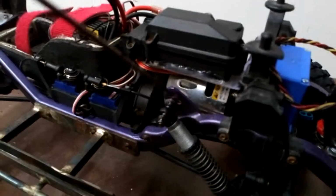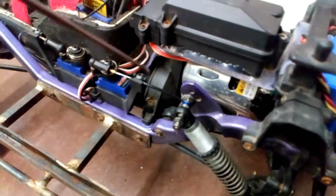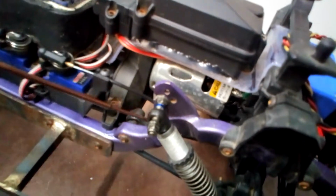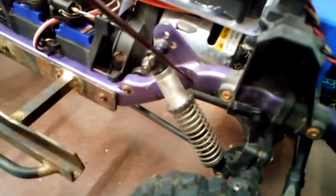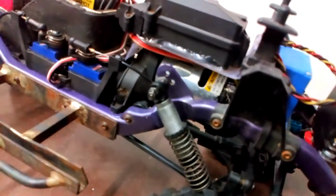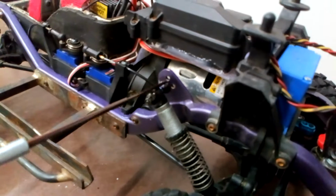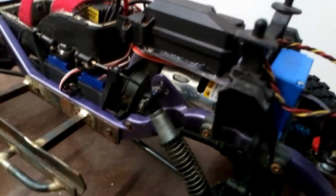and decided that the best course of action was to cut the chassis out along there at a 45 degree and along the back there, and that left a very small amount of rail just there, top and bottom. Once I'd done that, I filled the sides here where there should have been a gap, and again here, with silver solder, and then I had to sand all that down to make it smooth. And again I had to play with where the setting had to be, and if I use either of those there is a slight catch on the chassis rail, but that hole there everything clears.